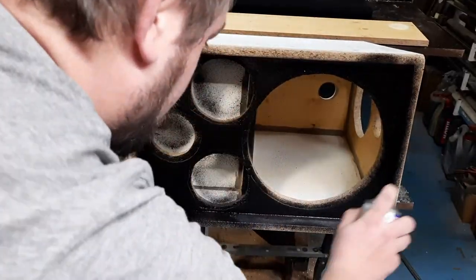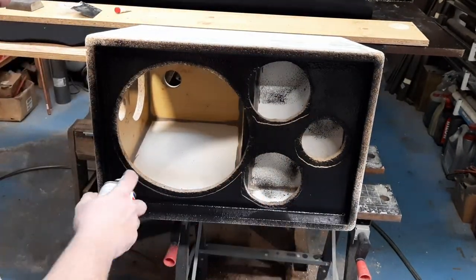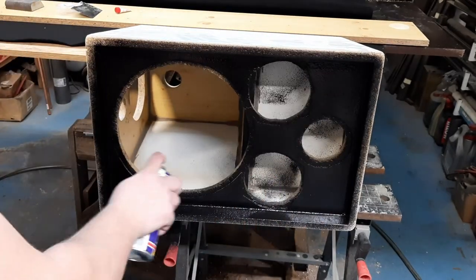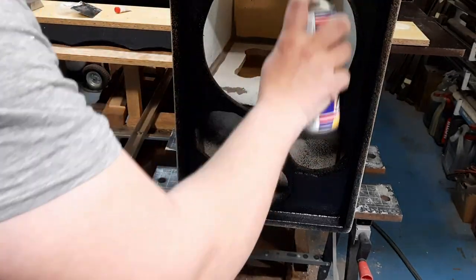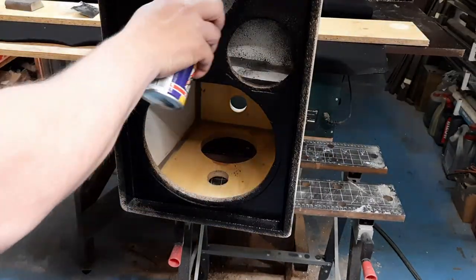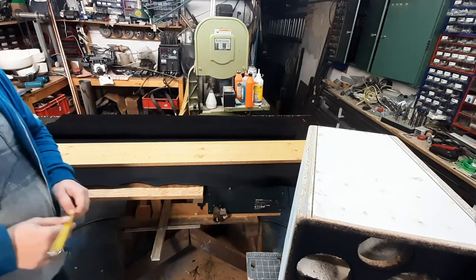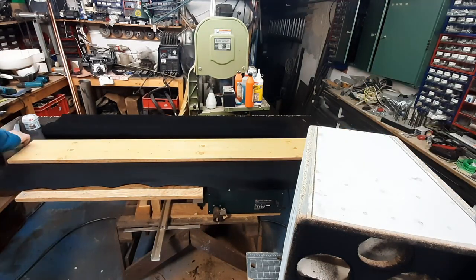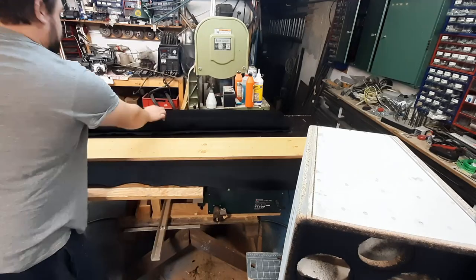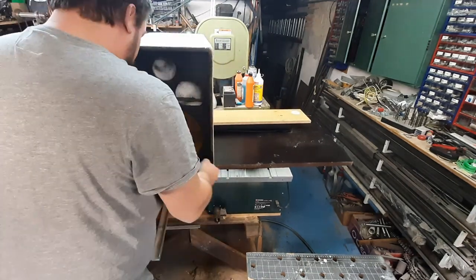And while we are watching me building the speakers, let's talk about those cheap drivers, especially the woofer. As it turns out, a speaker with a Kevlar membrane can have a manufacturing defect, as when the Chinese comrades were making the speakers, they probably stretched the Kevlar fabric too much, and that actually made tiny holes right through the membrane.